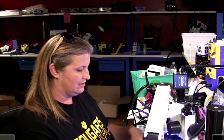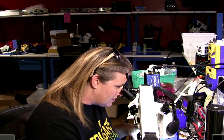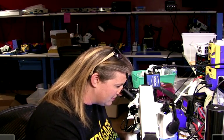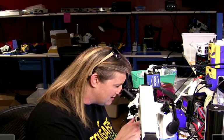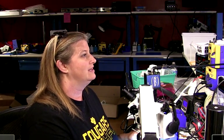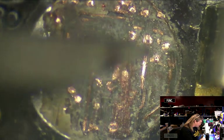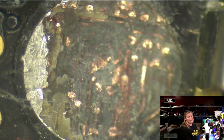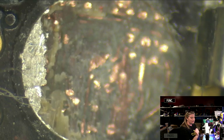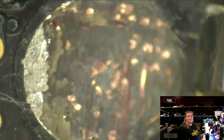Let's see what we can do here to fix it. This is just an example of: see damage, fix damage. We can kind of guess in here just by looking. On the schematic, there is not a picture of these traces — you have to figure that out yourself. When the first iPhone 6 with long screw damage came out, I sat here with a fiberglass pencil and just went through the board, used a multimeter to map those traces and figure out where they went. No schematic required.